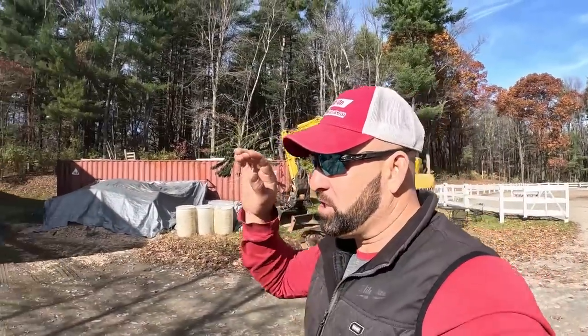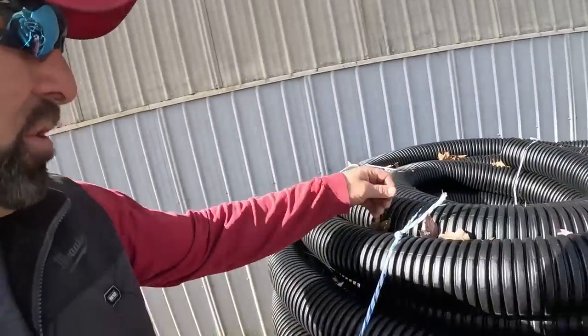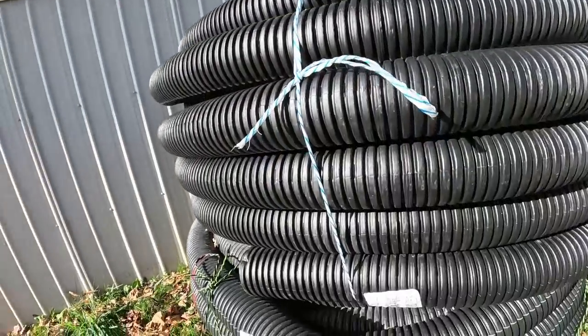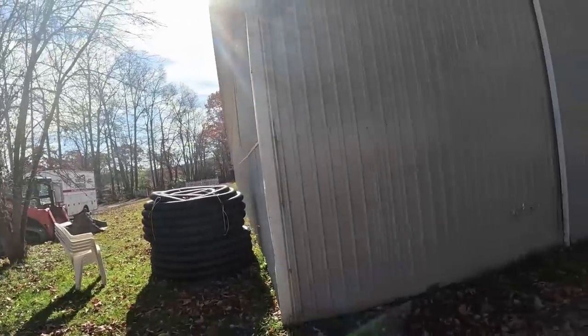We are using perforated corrugated pipe for French drain systems because that is the best. It's not like a footing drain. What these corrugated pipes do is cause turbulence in the system - it's basically self-cleaning. When leaves biodegrade and go down into the stone and pipe, the water hits these riffles and turbulence and actually cleans the pipe. It causes velocity like putting your thumb on a hose - you get a lot better spray. Do not use the solid smooth bottom with two holes - those will plug up and you're done.